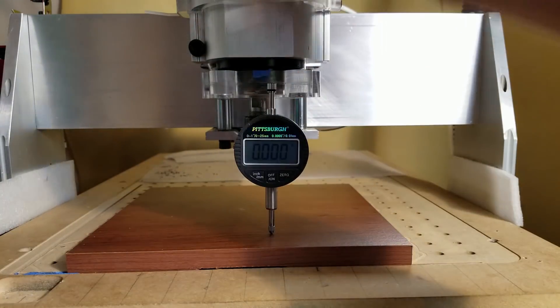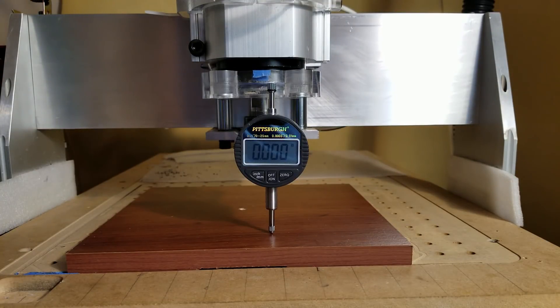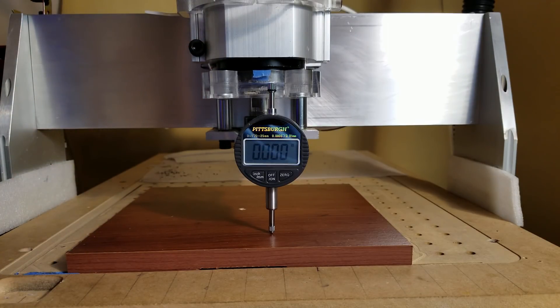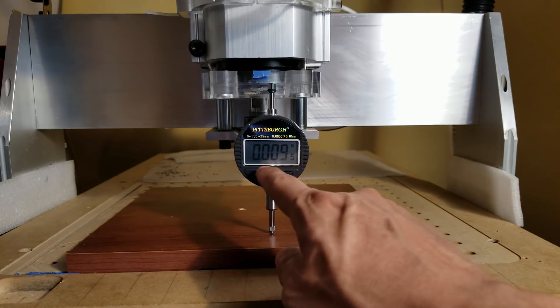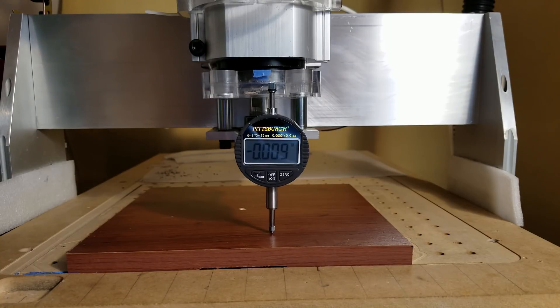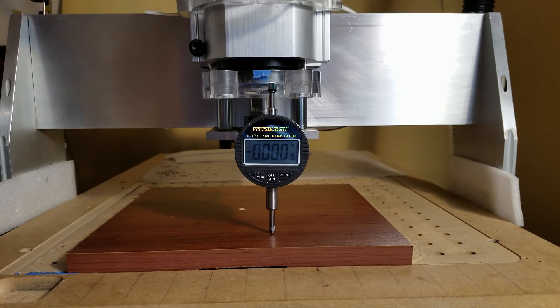I attached the linear rail in the back to the piece at the top of my Z-axis. Now when I apply pressure to try to tilt it back and forward, with just my hand at the top — similar to before — I actually get almost 0.009 or 0.010". Pushing it towards the back it's around the same, about 0.01" back and forward, and about the same towards the front.